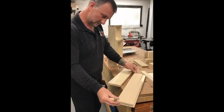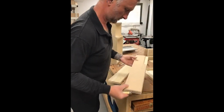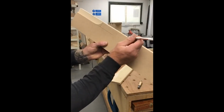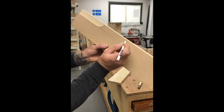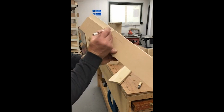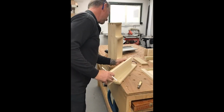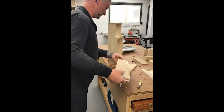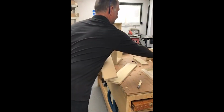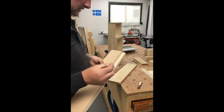So I'm going to line up my template, which is now ever so slightly, I don't know whether you can see this, ever so slightly smaller than my material. This is the piece I'm going to remove to take down. That's the bit I'm going to trim off, but I need to do the same in this area. So what I've got here to use, I'm making sure that I'm flush here and flush down the spine. I'm going to use a little washer or profile scribe device.